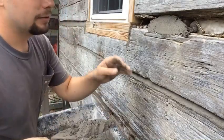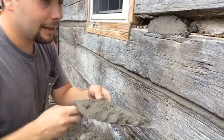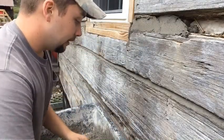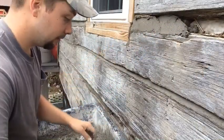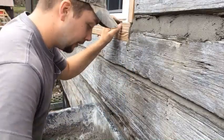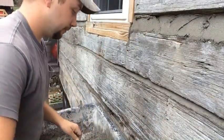And if you're trying to be real easy and you don't want to slide off your trowel, sometimes I'll pack it down like that, and that way it presses it firm. It's a little easier to work with that way. I'll fill up a spot probably 16 inches and then I'll try to work it in. I'll get a little space fixed up, get material in it first, and it's a little easier to smooth it up if you've got a bigger span.